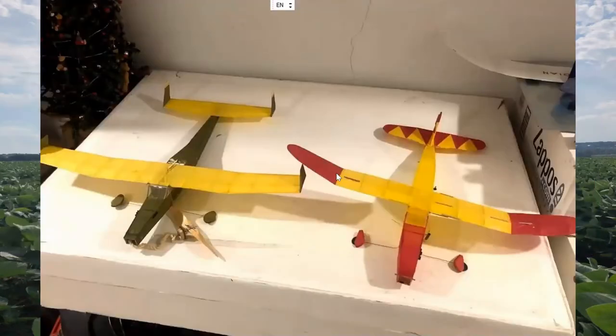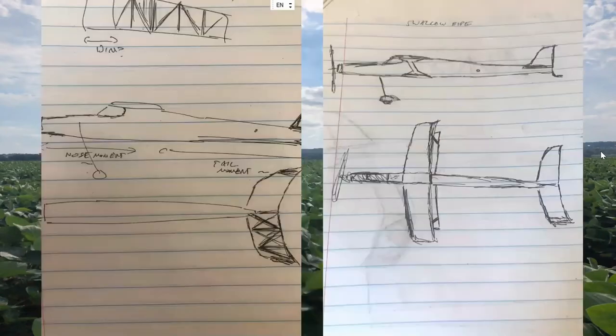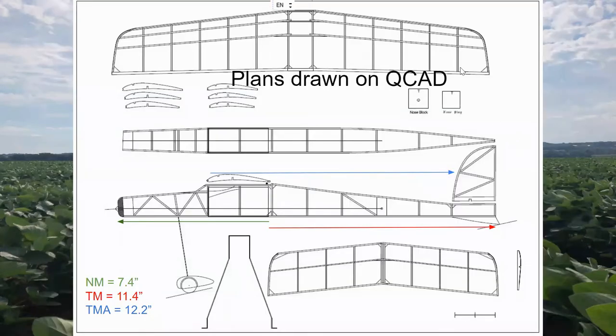Here's the current state of two of my embryo planes — obviously have seen some battle and needed replacement, which is part of why I decided to build the Nighthawk. Here are some initial concept sketches. I was originally thinking of going with a biplane, which I scrapped, but kept the basic fuselage shape, swept-back wing and tail, long tail moment, and relatively large horizontal stabilizer. I also considered a geodetic truss wing structure but skipped it for simplicity. I drew my initial plans on QCAD — the free trial is basic and old-fashioned, but has no time limit, so you can use it indefinitely.